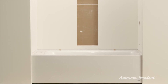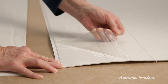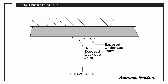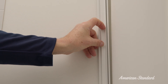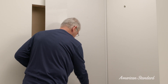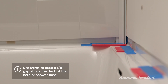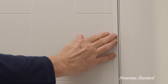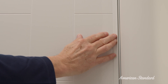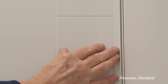Now that the wall area is prepared, it's time to install your wall panels. We are going to start with the right rear panel. Make sure the exposed underlap joint is facing you. Attach a corner trim piece to the opposite side of the panel and dry fit the panel with the trim piece squarely into the corner of the alcove on the right rear wall. Use shims to keep an eighth of an inch gap above the deck of the bath or shower base. You can also move the panel in or out from the corner trim if the alcove is not square. If necessary, the panel can be cut and trimmed to make sure the rear panel fully engages within the corner trim.